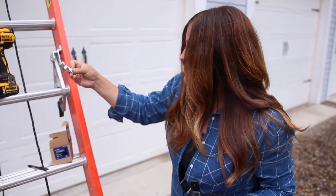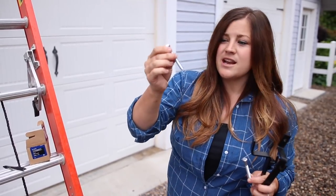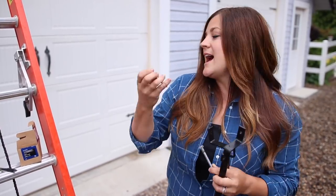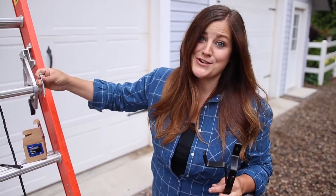These are 5/16-inch by 3-inch right here. When I put them into the piece of molding and into the side of the barn, I'm going to put them in at a slight angle so that when I set my basket on it, it can't fall forward. I have done this several times — I did this at our old home, that's how I installed my window baskets, and they held just great.